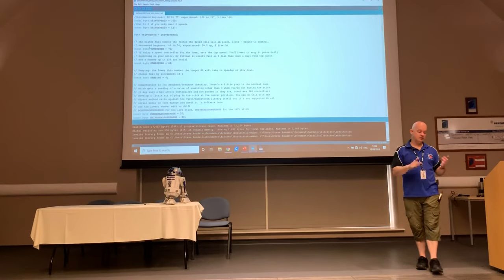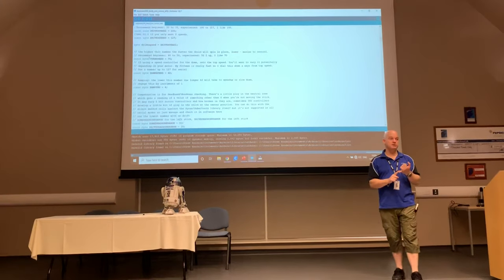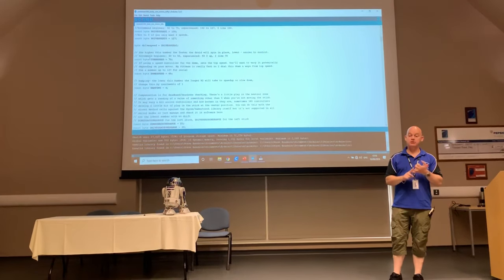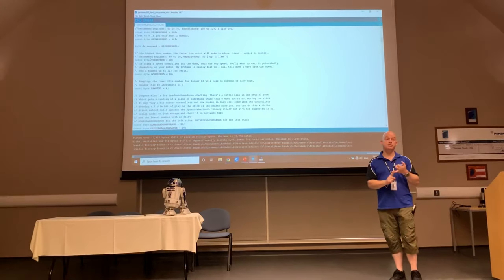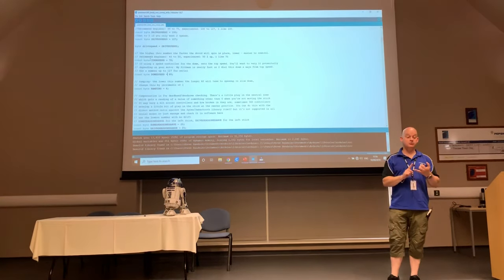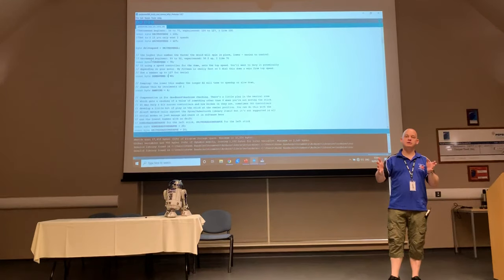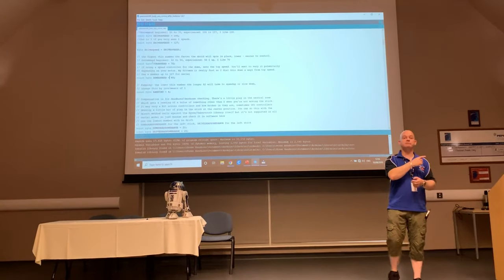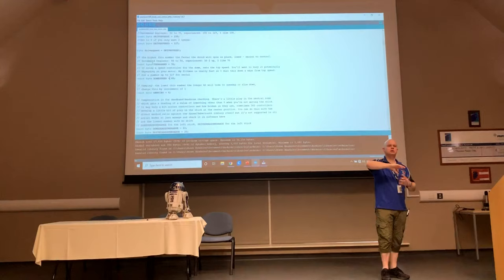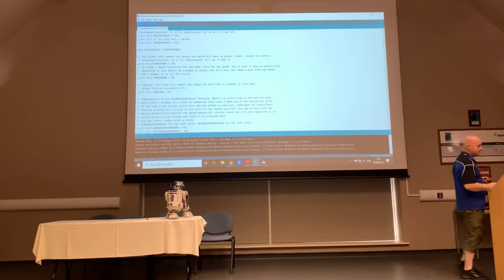One of the reasons I did that was, A, I'm a cheapskate, I had a spare drill kicking around that was knackered. The other thing which really works for me, and some of the events I take my droid to, is that the drill motor's got a clutch built into it. So if you're spinning that dome around and suddenly a kid tries to grab hold of it, the clutch will slip as opposed to it taking the kid's arm off. Sometimes I do the clutch up tight just to take the kid's arm off. Let the wood be.